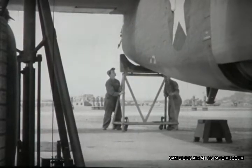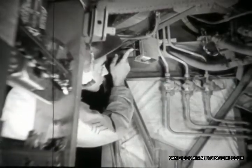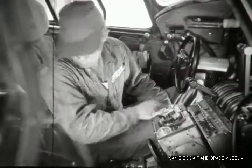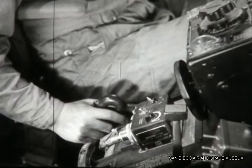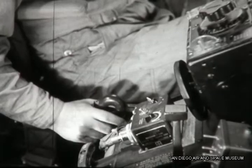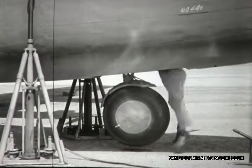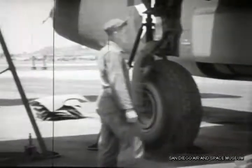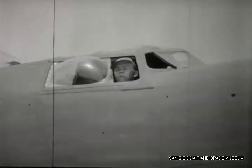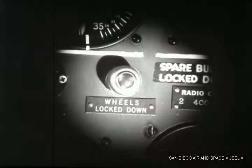It's a fancy tail support, but in a pinch you may have to use a little ingenuity. For pressure to raise the landing gear, Williams now turns on the auxiliary hydraulic pump. With pressure up, Duffy is ready to operate the landing gear selector valve control, which is safetied by that little button on the top. Nose gear is confirmed clear, and up she goes. The gears unlock, causing the green tell-tale light to go off.